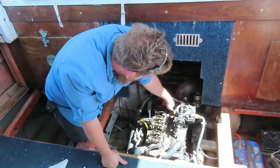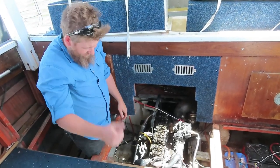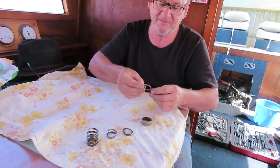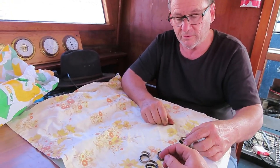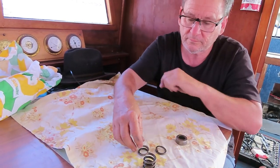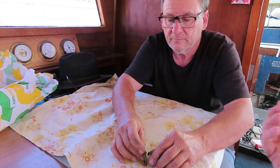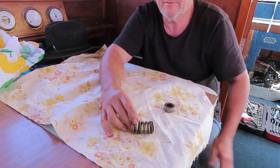What does that mean about the valve spring? That's exactly what it means. Sweet. Righto. We're a bit lucky, aren't we, Dad? Oh, mate, lottery ticket. So, broken valve spring and the little spring top cover for it. The collets were still on, the retainer was still on, the spring was broken and the valve was hanging down, so we lost compression on that cylinder. But it didn't hang down far enough for the piston to contact it and damage the valve.